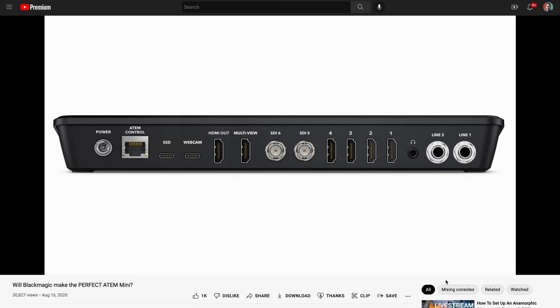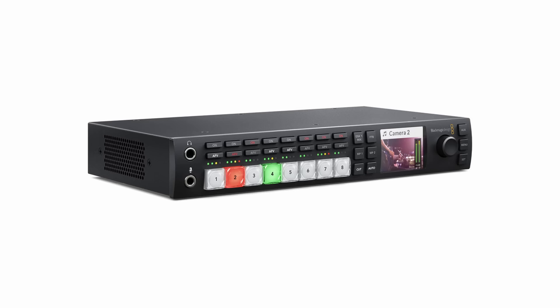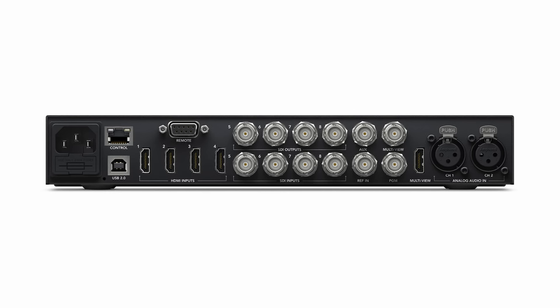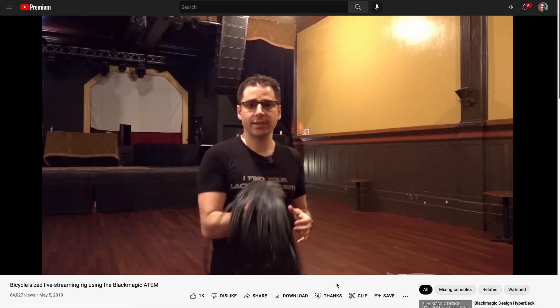Like I said in my original ATEM wishlist video, I would have liked to see a mix of SDI and HDMI — maybe three SDI and one HDMI on the smaller ones, and six SDI and two HDMI on the Extreme. Remember the TV Studio HD? I used that one for years. It has four HDMI and four SDI, and even half and half was a great mix. I used SDI for long cable runs to far-away cameras or the presenter's laptop on stage, and HDMI for local sources like a slide deck laptop, a motion background player, or an iPad. There's always going to be a mix of HDMI and SDI sources in a production, so if you have all of one type you're always going to need some sort of converter.